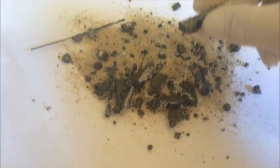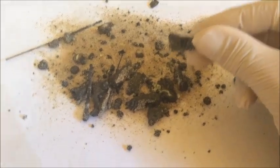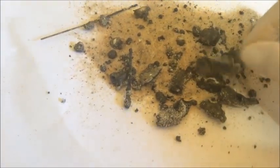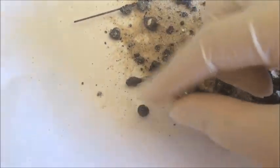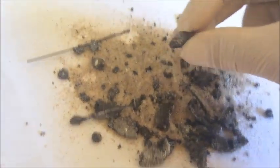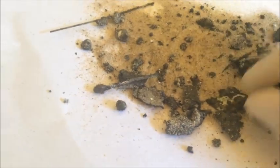This looks a lot nicer than I remember it looking. I remember at the beach at the time thinking that the slag looked pretty bad, but it looks pretty good. You can see some nice pieces — like this piece here is a very spherical piece. It's not obviously immediately recognisable as vanadium, but vanadium does get a sort of oxide sheen on it that makes it rainbow-coloured, which this doesn't have. That's probably just because there's a lot of aluminium oxide fused together with it.